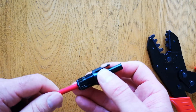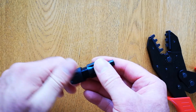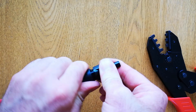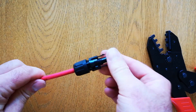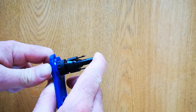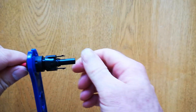Push that inside the connector until it goes click, and then screw the part on the back securing nut. If you have an MC4 tightening tool you can use that just to put on the nut, and that helps you keep hold of it as you tighten it up.